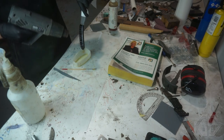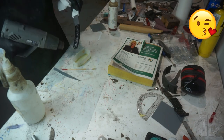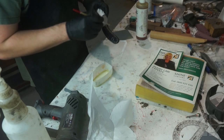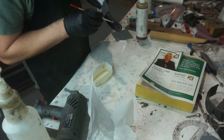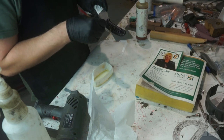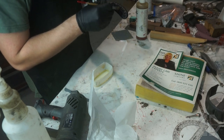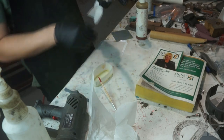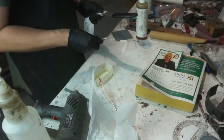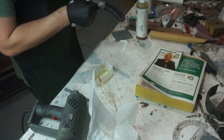What you want to see is the epoxy starting to drip — that means you're getting the wrap to soak in and penetrate nice and deep. Now grab some baking paper and start wiping up the excess. At the top layer you want to thin this out as much as possible. You can see there are little puddles of epoxy — you want to spread those out and move quickly, because now that we've hit it with heat it's going to want to set a lot quicker. Grab some q-tips and start cleaning up the excess that's slid onto the front.